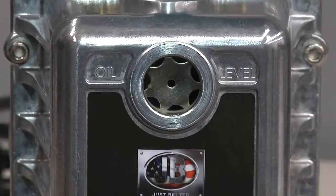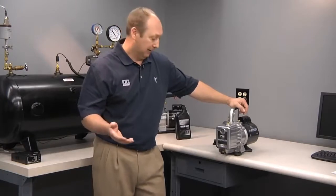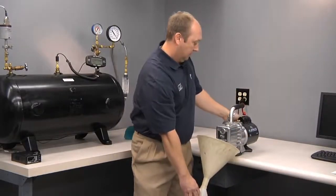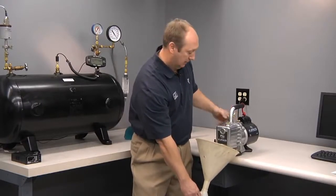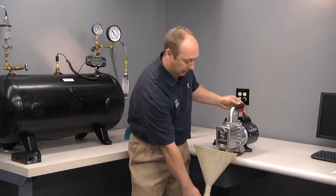The hotter the oil, the better, as it will drain faster. One trick of the trade to drain oil a little bit faster: you can actually start your pump and cover the exhaust, which will force the oil through the oil drain. So start the pump, loosen the cap, and open the valve. Now by gently pressing your hand on the exhaust, you're forcing the oil out of the oil drain.